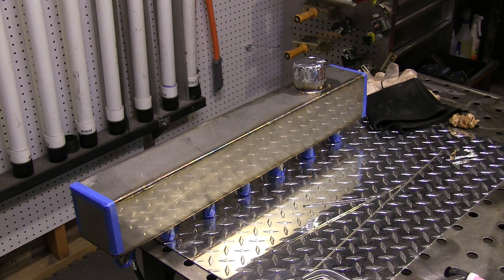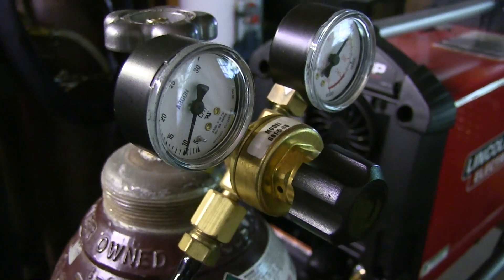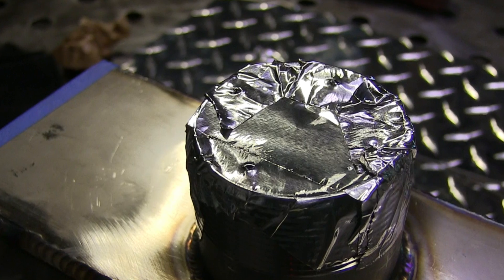It is possible to use a splitter Y off one flow meter, but it's best to have either a dual flow meter regulator or just use a whole separate bottle of argon. I've got several bottles of argon, so I'm using a separate bottle today — set to 10 CFH, really all I need. I'm poking some vent holes all around the edges of this little inlet, and the reason on the edges and not the center is that as I move the part around, I want a vent hole always at the very top. Purging is displacing the oxygen from the back side of the weld so that the molten metal won't oxidize. Argon is most commonly used; occasionally nitrogen is used. It helps to think of it as filling a container with water — argon is heavier than air, so it generally fills an odd shape just like water would.